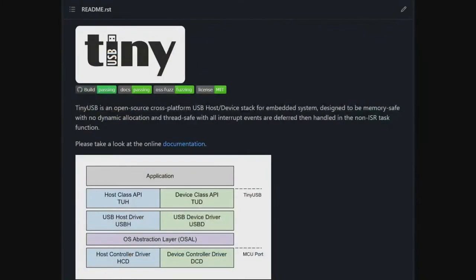If you want to use the USB core for this chip series, we have support for the NXP IMX-RT in TinyUSB. TAC, one of our developers supported by Adafruit, has done an excellent job adding support for the NXP series. The NXP LPC series was actually one of the first chips supported by TinyUSB, and we definitely have support for the IMX series as well. It's open source and a great way to start structuring your project if you're using ARM GCC, which is what TinyUSB builds in.